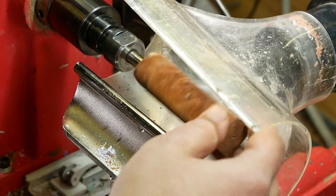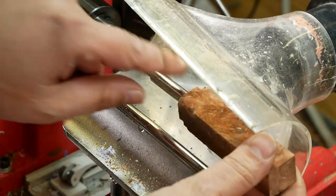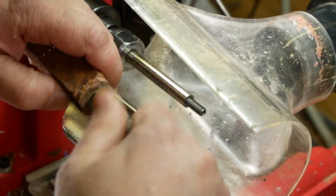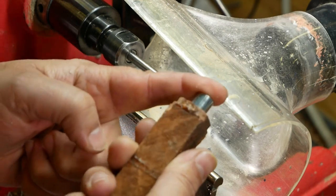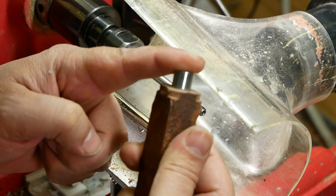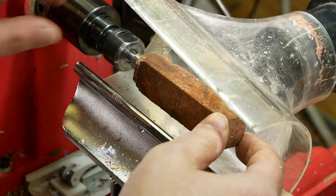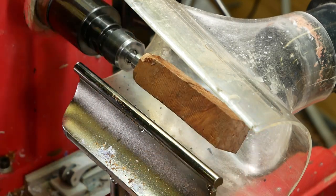Take the barrel off and check the end. Chamfer the opening to remove any burrs from trimming and to make pressing just a little easier. Slide the bushing in and make sure it sits straight before moving to the next step. Now I remount the barrel onto the mandrel along with the bushing. Thread the barrel all the way onto the mandrel and then back it off a few turns.